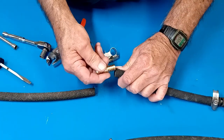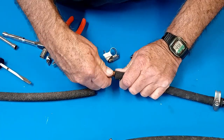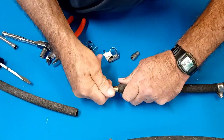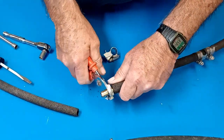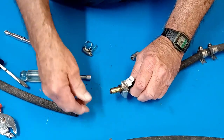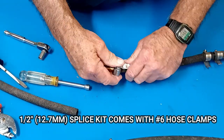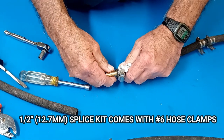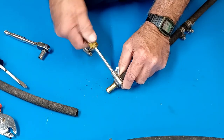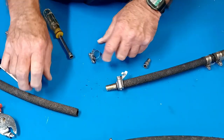We'll start with the half inch hose. The first step is to insert the hose nip about halfway into the hose. This can be difficult and I use some slip joint pliers for extra leverage. Now slip your clamp into place — I'm using a 5/16 inch nut driver to tighten it. You can also use a flat-bladed screwdriver if you wish, but you want to get it good and tight.